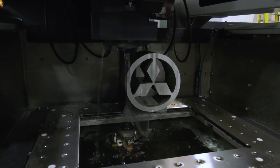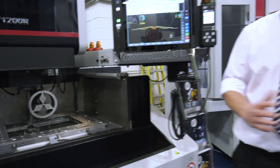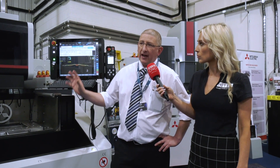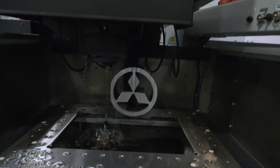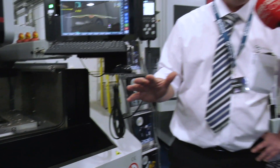On the R-level machine we also have a function called Operation Data Output, which gives management full tracking of all running costs, lifetime of servo amp batteries, service intervals, and more — that's a standard feature. There's also something called Core Hold, which enables you, as you wire erode a cavity up to 50mm thick steel, to use the brass wire to weld the part in as you go rather than D-tagging, saving massive time getting the slugs out of the cavity.